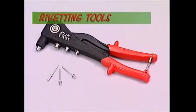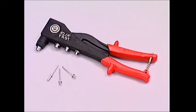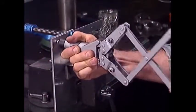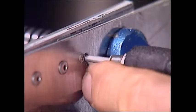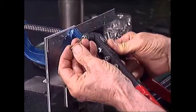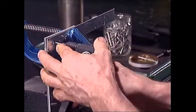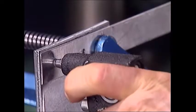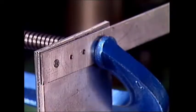There are so many applications for rivets that there is a variety of types and tools for doing the riveting. The concertina rivet gun, sometimes called lazy tongs, puts larger rivets in heavy materials. Riveting pliers are convenient for occasional riveting of light materials. The rivet goes into the riveting tool which will pull this end of the mandrel back through the body of the rivet. Because the head is bigger than the hole through the body, it'll swell out as it comes through. Finally, the mandrel will snap under the pressure and fall out, leaving the rivet body gripping the two sheets of aluminium together.